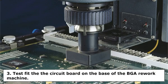1. The need to remove components or other hardware to allow the location to fit under the nozzle without interference. If components need to be removed, see the appropriate procedure. Properly label removed components so that they can be replaced. 2. The need to apply heat shields using high-temperature tape or aluminum foil. 3. The location and placement of thermocouples.